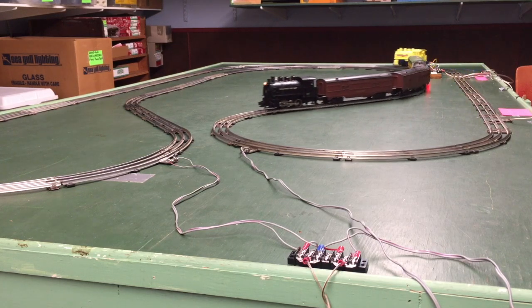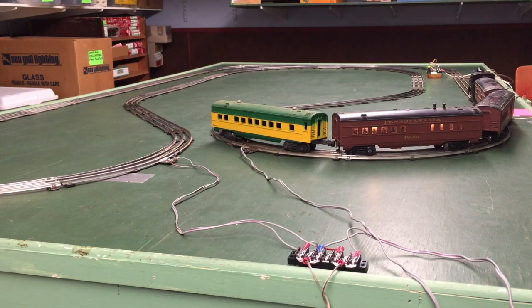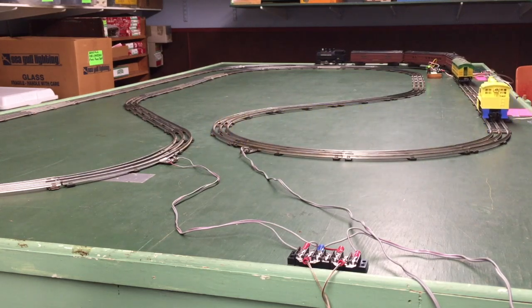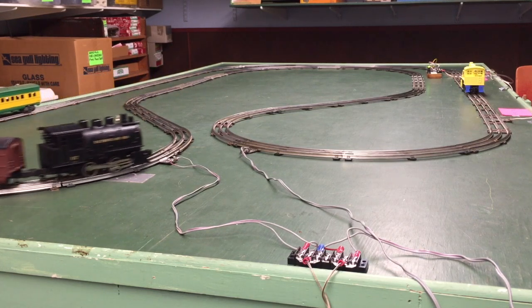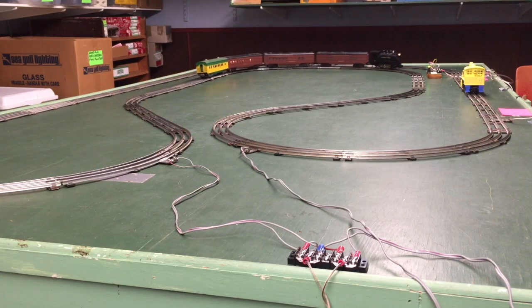The constraint is that the delay can't be too long or the block will still be powered when that train gets around. You can see it's just going back to green as the passenger train pulls into the block. When the yellow engine goes across, it goes to red and stays red, then returns to green — the relay goes back to its normally open position and turns the power off to the block. The bottom line is that using this method with the DZ-1012 gives you more flexibility over using the DZ-1011 as shown in part two.